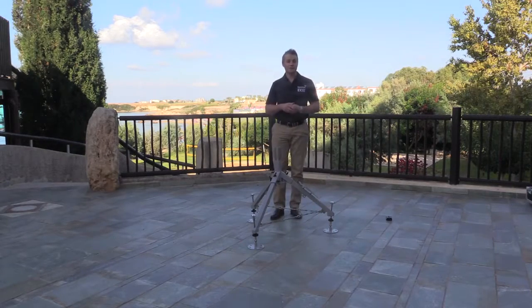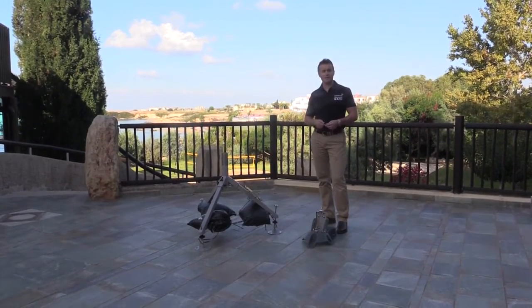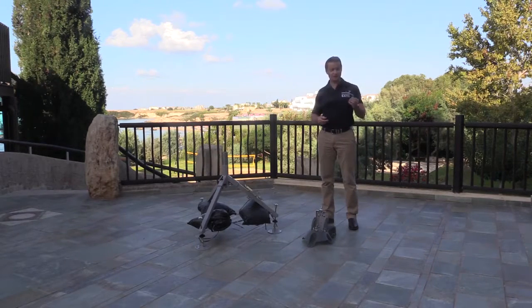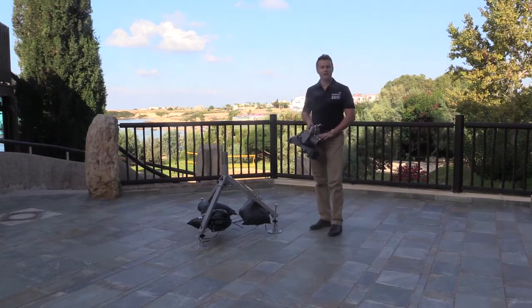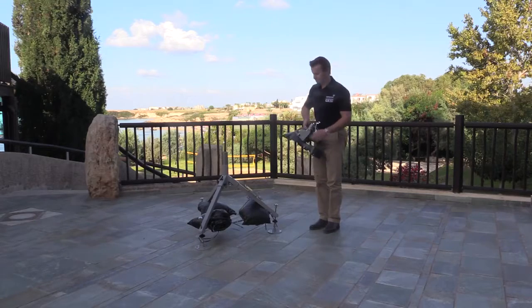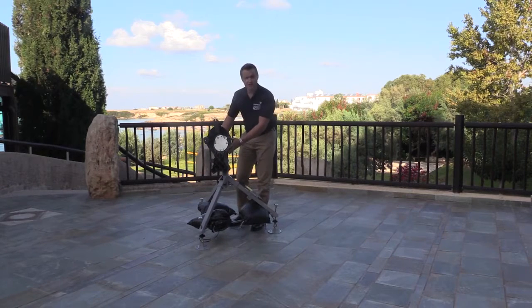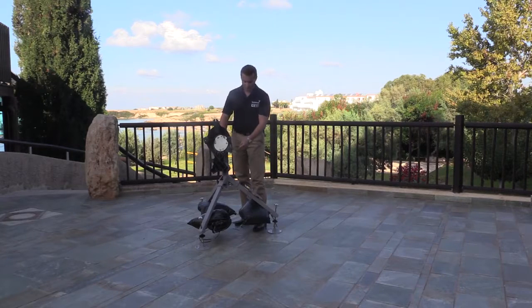The tripod is now ready to receive the backing assembly. Within the kit you'll need a couple of things: there's a crank for the elevation screw that just slips on, and you also need the spanner provided in the kit to tighten the collar onto the tripod. Simply place the backing unit onto the tripod as far as it can go, orient it roughly in the direction of the satellite, and then tension up the collar slightly — not too tight because we'll probably need to move it later.